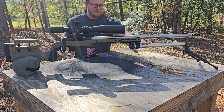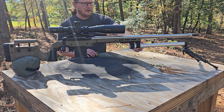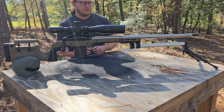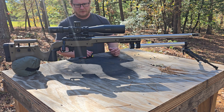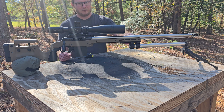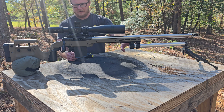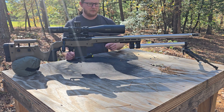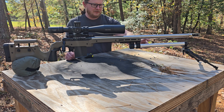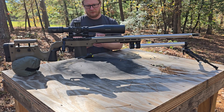As far as rigidity goes, the aluminum tube is not going to bend. I did some calculations — this tube would require more than 500 pounds of force before it even bent about a tenth of an inch. The rifle itself weighs 17 pounds and is putting maybe 12 or 13 pounds of pressure here, so the flex in this tube is probably less than ten-thousandths of an inch.